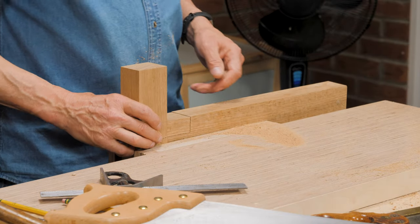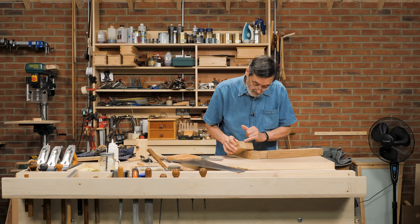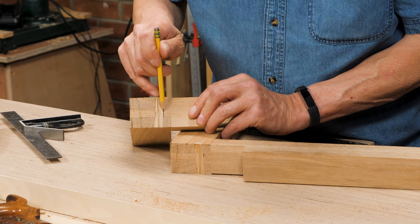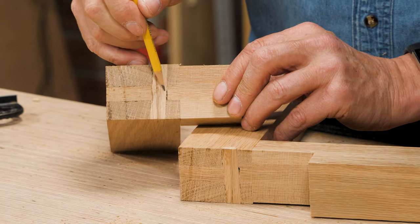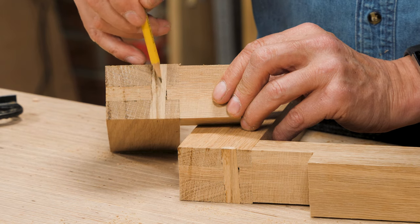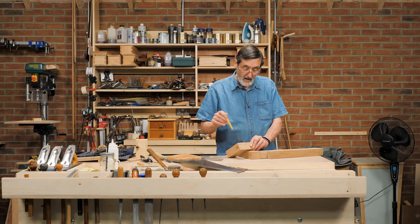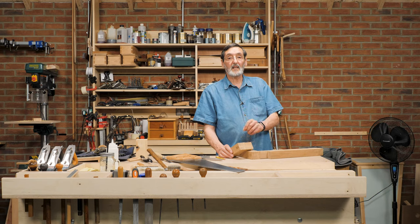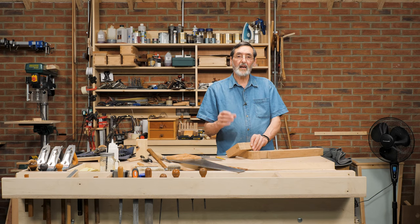When we take this apart, let's take a look at what we've got. It did stay together. I've got a bend in the wood here — this is where the peg bent and I expected it to. This gap on this piece, same on that one, is where the wood compressed, but it's also still an offset hole. This section of wood has compressed because it's between these two fixed points. I can see how it's bent — confirmation of the two offset holes. It becomes a permanent bend in that wood, and this is going to be retaining that joint for the rest of its life. It could be a hundred, two hundred, even five hundred years. This was an amazing development in woodworking.